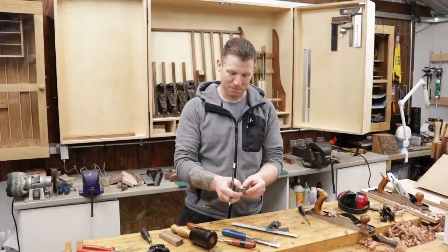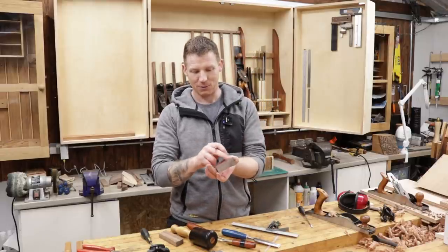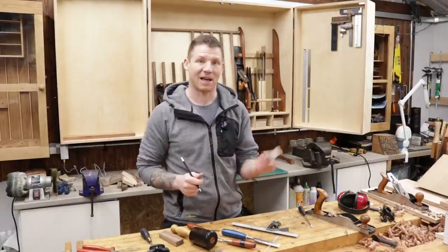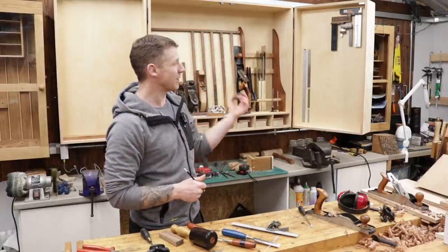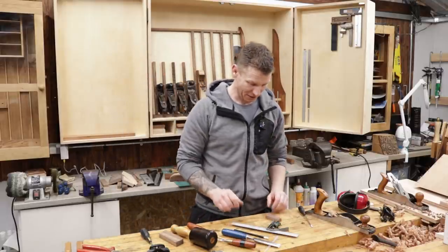So take this to the bandsaw, cut a slot out of it, and then we're going to put a nice little decorative chamfer on the edges, two screws with two countersunk heads, and we'll screw it up, and then we can remove them and we can put some finish on all these when we have everything in place. So let's get on and do it.